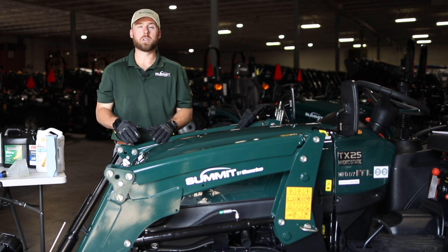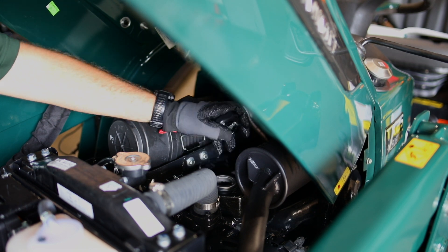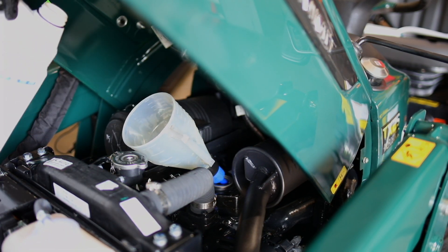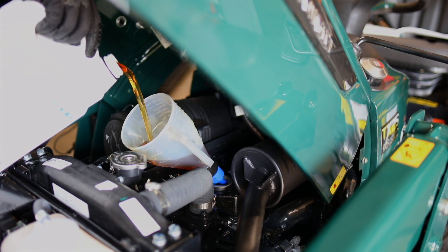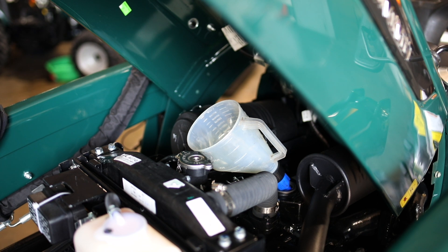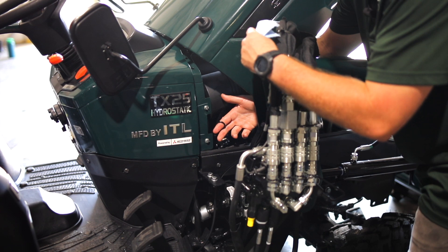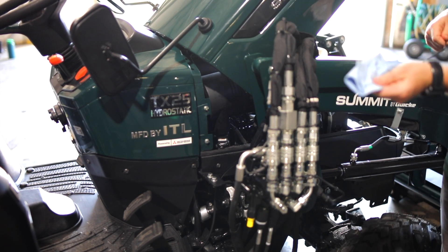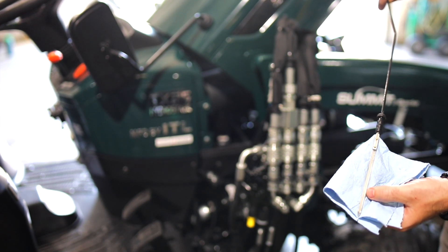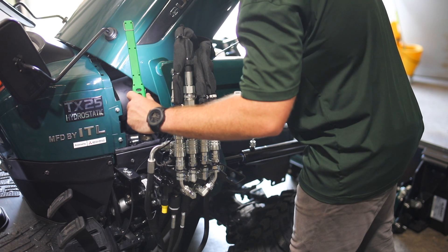So we drained our fluid, changed our filters. Now it's time to add the oil back to the tractor. I'm going to pop the hood, remove the cap off the engine, add our funnel, then add some engine oil. I've added a gallon of oil. The book calls for 1.1 gallons, but I prefer to add one gallon, put my cap back on, let everything settle, then check my oil and see if I need to add from there. Now we're going to check the engine oil by pulling the dipstick, located on the right side towards the back towards the firewall. Once it's pulled, clean it off — there are two divots in the oil stick, a lower and an upper. We recommend adding about half a quart until you get to that desired location near the upper. You may need a flashlight just since it is a smaller hole.